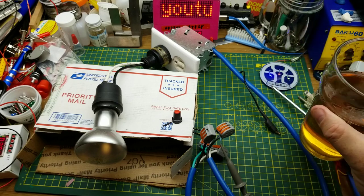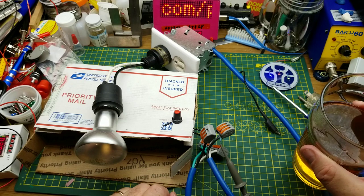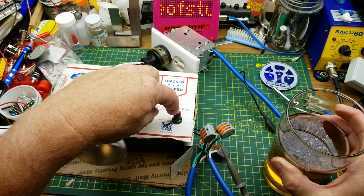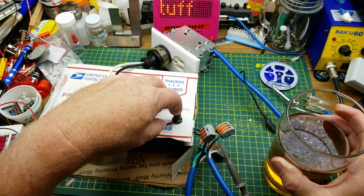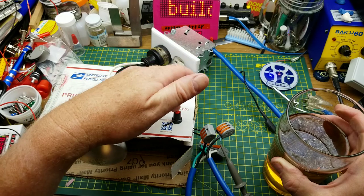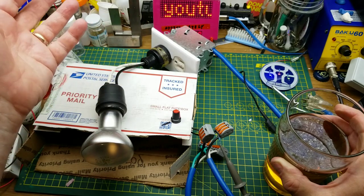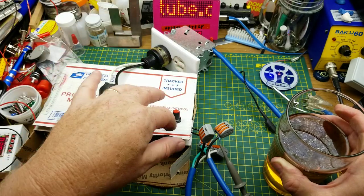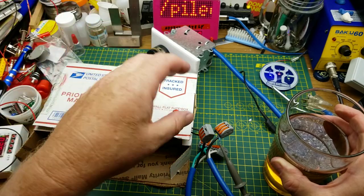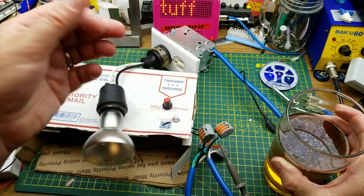Right. Well, that was interesting and kind of fun and a good refresher for me on light dimming in the old school kind of way. So the old school stage lighting dimmers were essentially that, just bigger with better protection, with a much bigger triac, obviously, capable of handling 15 amps or more, and series inductors and filters and filters and filters. But essentially it's the same circuit. There's only a few components to do the basic job.